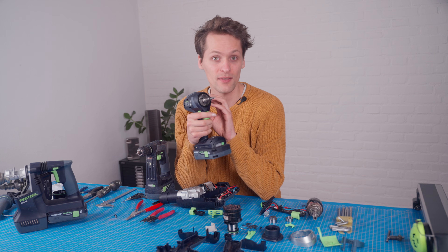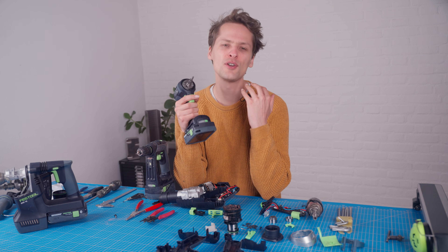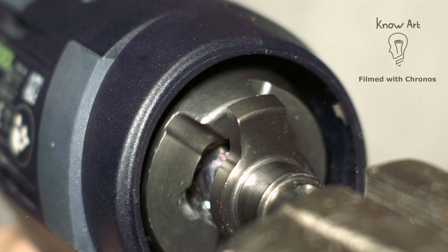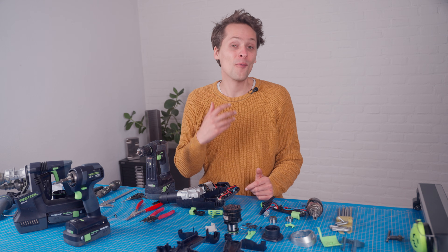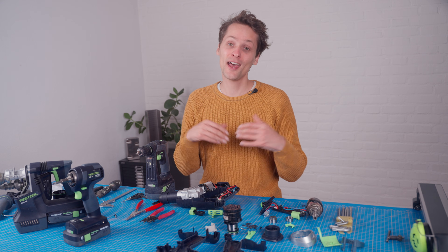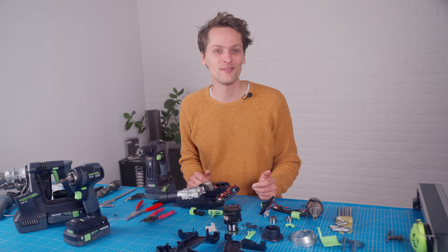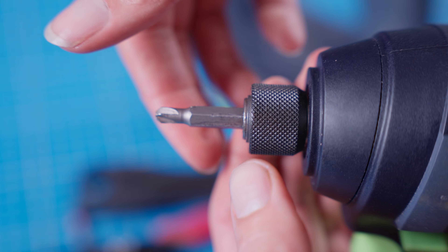It failed the test in a way I hadn't considered, which is always refreshing. It's tricky to engineer one of these because you have to get the harmonics right, which are notoriously hard to model — you want the hammer to hit the anvil full-on, and for a single speed that would be easy, but you want optimal behavior at every speed. Some brands struggle with that; the Torque Test Channel has a great video on it which I'll link below.